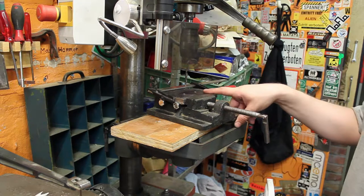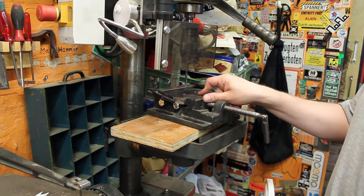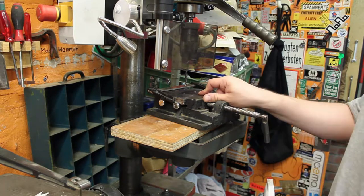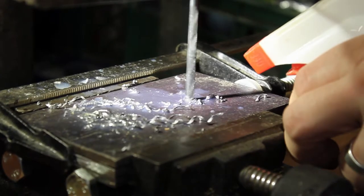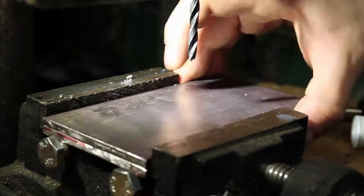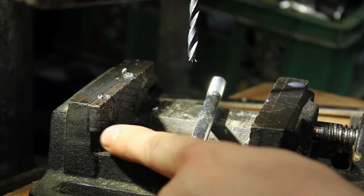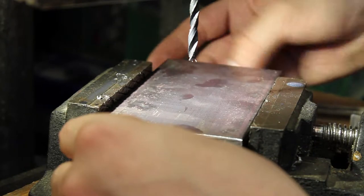So this should keep them all in place. Now I will drill these two holes, so I should get the exact same result. Then I can take it all apart and put another two underneath, always keeping the first one as original to take measurements off of. This way they should all turn out the same — except one, which I need to deliberately offset 20mm, because that one will poke out. The clamping part doesn't go completely down, so I'll put these spacer bolts under here to lift up the lower one into the region where the jaws can actually clamp down on it.